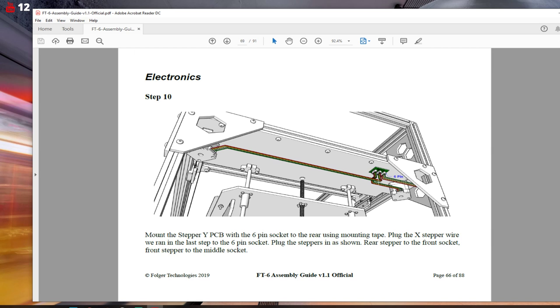Here's my thought. First of all, this printer is going to generate vibrations, so if anything's going to wiggle loose, it's going to wiggle loose over here. And the other thing is you have three connectors here, so these wires are going to dangle and droop, so that's additional load on the part. I just didn't want to be in the middle of a print and find that thing hanging on the bed. So it's much easier to drill two holes in there and mount the guy up and call it good. I put some spare nylon spacers I had kicking around to hold mine in place.